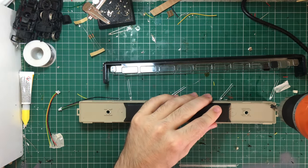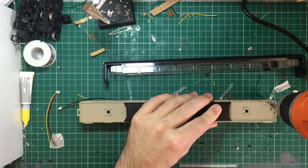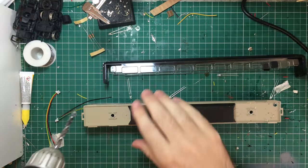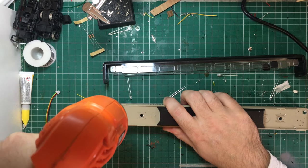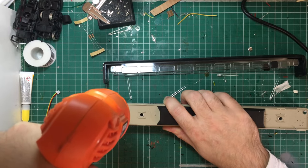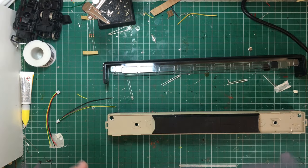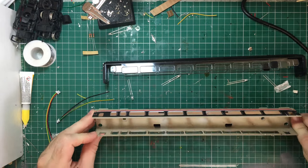So now I need to drill my holes. I've planned where I'm going to put them, so now I'm going to get my drill. I'll go quite slowly — I'll let the weight of the drill do all the work. Nice and slow so I'm not going to get any cracking or damage to the rest of the vehicle. I only want one hole on either end — I don't want to have to patch it up with lots of plastic holes. I'm using a fairly small bit, just to allow enough space for the wires to go through but not necessarily the plugs themselves. I want them to be captive on the outside — I'm going to glue them in.